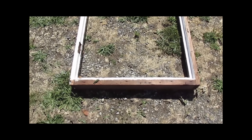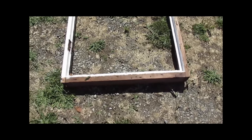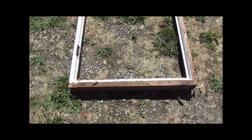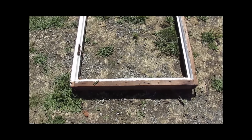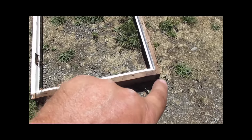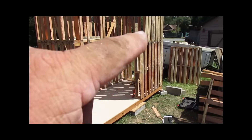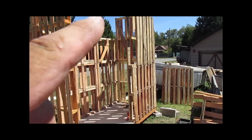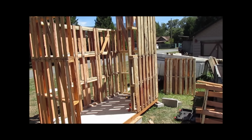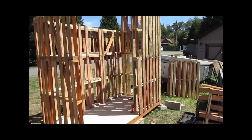I'm taking the frame here — from here to here, the outside measurement is 32 inches. I want to make a two-by-four frame around it, just like a case, so the inside measurement needs to be 32 inches. Once I cut that size of hole in the front, I'll be able to walk in and out, finish it, get it solid, and later when I go to put the door in it will be no problem.